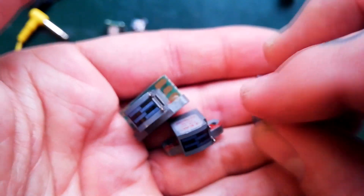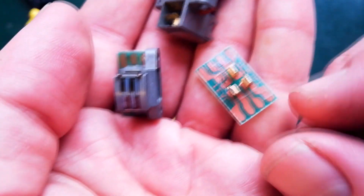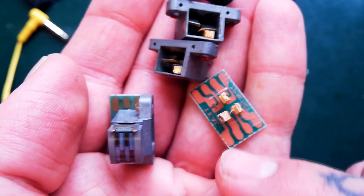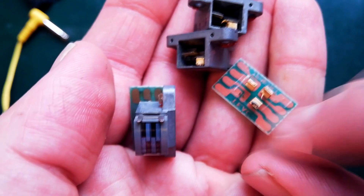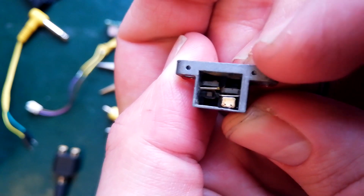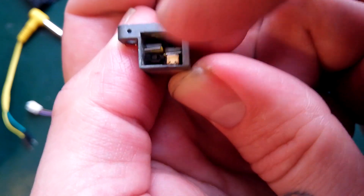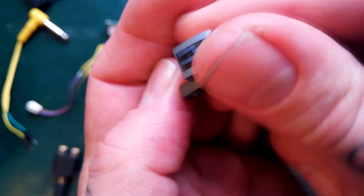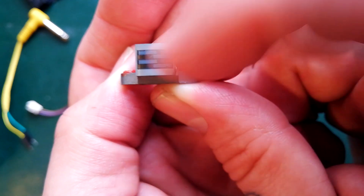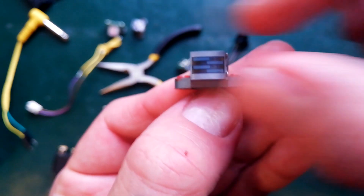When I have had bad tape heads, it's because inside — maybe it'll make more sense if I showed you the board that's broken off — these little printed circuit boards, these little white bits are the mountings for tiny little coils of wire. Basically what you've got here is four little electromagnets. There's a ferrite core and then a coil of wire around that. These little horizontal partitions are just keeping this pair and this pair electrically isolated from each other. The design of this casing is such that the magnetic field created by each of these four electromagnets can only come out of one of these four slots, and that's how you get the tape broken into four regions.